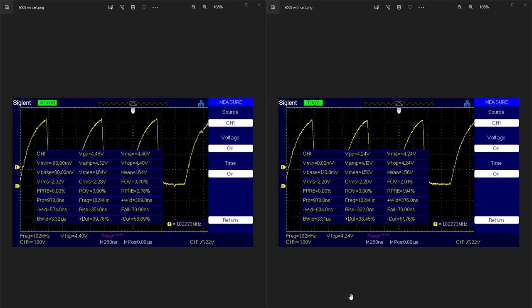I'm noticing that the clock two output across these chips is not the same. The MOS 6502AD chip handled it the best and I had very little problems with him. All the other ones out there — even the pseudo MOS chips with that weird 1837 date code — didn't handle the load on the clock line as well. The SY chip — I looked it up, it's Synertech — did pretty decent, but even still, when I added a cartridge, I started running some instability. Especially the Kung Fu Flash cart — that thing is very picky when it comes to timings.